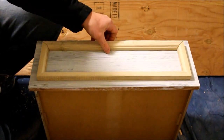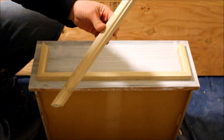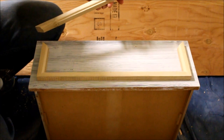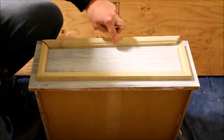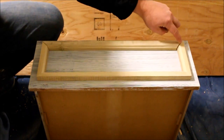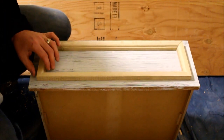So we've got our trim all built. This is just a small piece of wood — they were nice and thin, pretty non-uniform; they're the ends that I get. I've got a local cabinet maker and he just puts all these little pieces of wood, usually about an inch and a half by an inch or so. I do have to cut them down a little bit and then I use a router to get this detail here. We decided we wanted to do the detail on the inside and the handle is going to go right here in the center. I'll use a belt sander to bring that down a little bit so it looks nice and even.